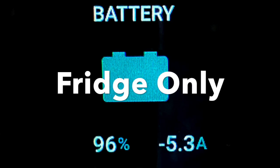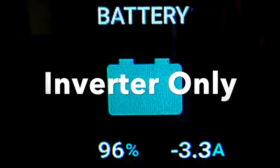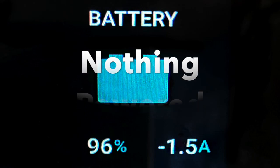If I have just the fridge on, it uses about 5.3 amps. The inverter alone uses about 3.3 amps. That adds up to 8.6 amps, which is close enough to 8.9 amps with a little fudge factor. When I turned everything off — including the inverter and the fridge — I noticed I was still getting a 1.5 amp draw. Not sure what that would be from, but something I will investigate. It's possible there are other things always using power, or it may be normal for a lithium battery system.